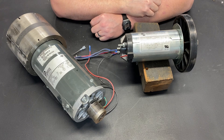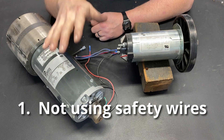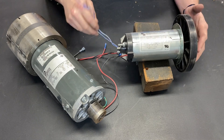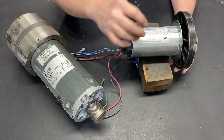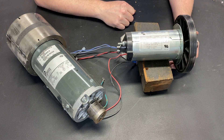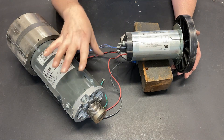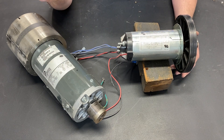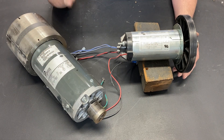Greetings fellow DIYer and welcome to my video. The first mistake that I see is not using safety wires. Now what do I mean when I say a safety wire? Well on this motor it's blue wires, on this motor it's this green wire. I do not see a green wire on this particular motor and if I was using this for a project I would actually add one. The purpose of the green wire is to ground the chassis — it grounds the body of the motor and typically whatever frame it's being attached to.